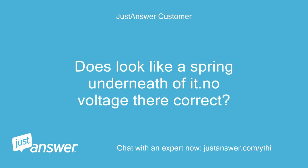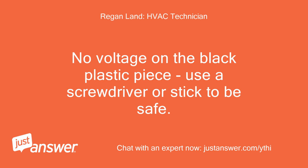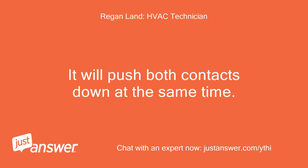No voltage there, correct? Only on the contacts. No voltage on the black plastic piece, use a screwdriver or stick to be safe. Looking at the pic, the plastic piece is just below the brown/yellow wire. It will push both contacts down at the same time.